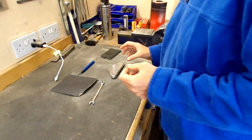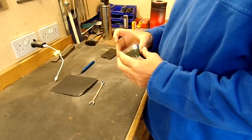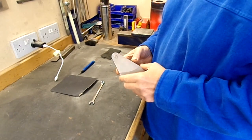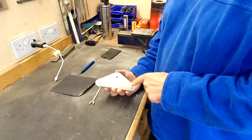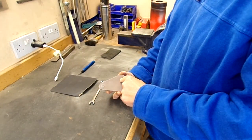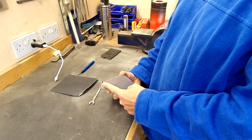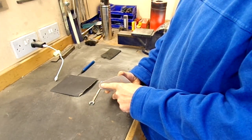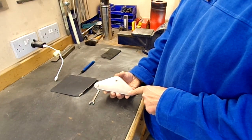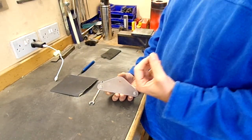Bad planning — I have to admit the camera battery went flat, so I spent a lot of time talking to myself and demonstrating to a dead camera. The state we're at: as I said, I was going to drill and ream these holes. With the grip pins holding it all together I drilled one hole 4.5 millimeters and reamed it to 3/16th, put a bolt in, did the other one the same — 4.5, reamed, bolt in — and then this one 7.5 millimeters and reamed to 8 to take bushes.